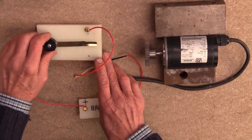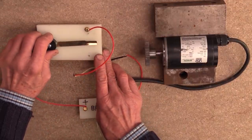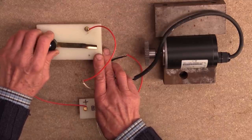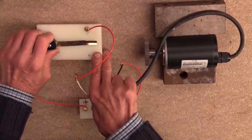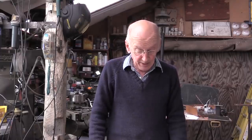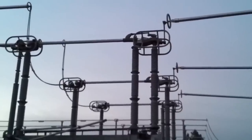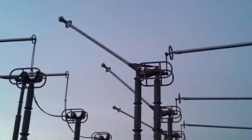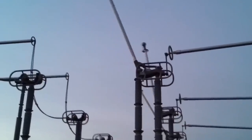So that's what lightning is - it's a column of charged ionized air. It's the same with the switch contacts. When the switch is about to make, or just after it breaks, electricity is continuing to flow through this ionized air, and that's making the contact spark. So for switching really high voltages, arcing is a very big problem and quite spectacular.